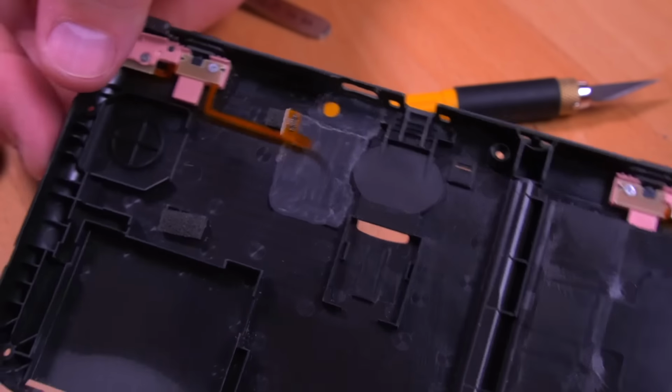Now go ahead and connect the capture board to the 3 ribbon cables that we installed onto the motherboard. And then use one of the exterior screws to secure the board. You don't want to screw it all the way in, just enough so that it looks like this. Next, we can go ahead and install the analog stick. And then we'll go ahead and solder these 2 wires to the charging port as shown. This is what enables us to charge the 3DS via the USB-C port.